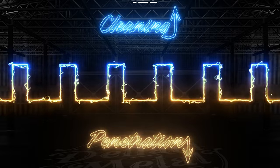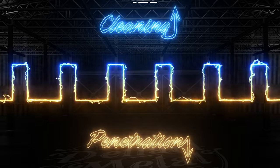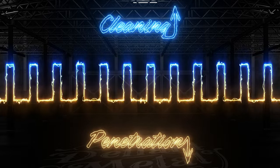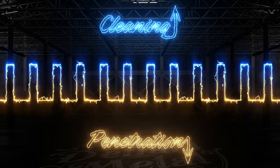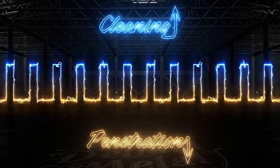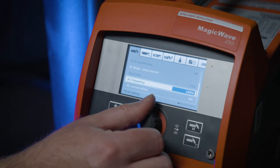If you are using an inverter machine, you have even more adjustment options. Since it's already changing the electrical frequency on the way in, you now have that as an adjustment option too. If this is a standard 60 hertz frequency square wave — meaning it cycles 60 times per second — if we increase that frequency to 120 hertz, you are increasing the amount of cycles per second to 120. The balance of how long each side of the arc stays remains as set; it just does more of them faster. Welding at that high frequency 120 hertz, you will notice a much higher pitch sound.